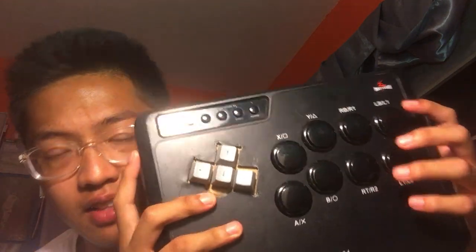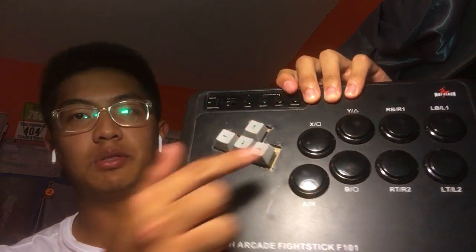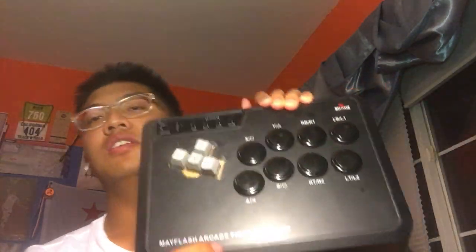That's what I mean. So basically, what I started off doing was you have to measure your switch, right? You can kind of see there's that skinnier part, and then there's an outer layer. This outer layer of the switch, not the keycap, the switch, is what's going to be holding your switch up on the cardboard plate. So you gotta measure the skinnier layer, so that when you pop it in the cut, it won't slide in. Once you got that, make a little WASD shape or whatever shape you want, and make a cardboard cutout of it. It's cardboard, but it's actually very sturdy, just because it's only this much cardboard, and it's super glued. I'll get into that later.